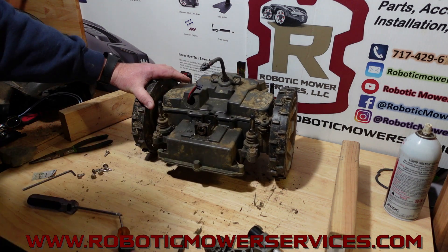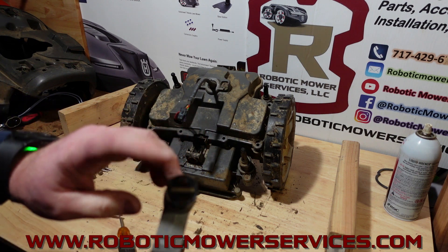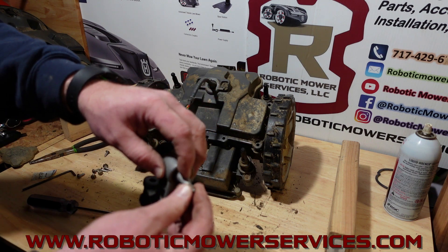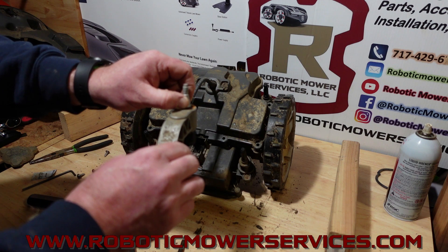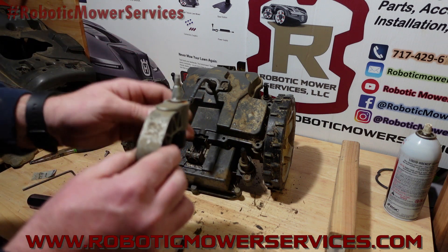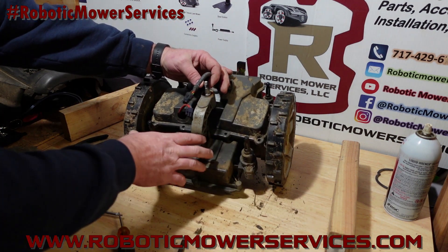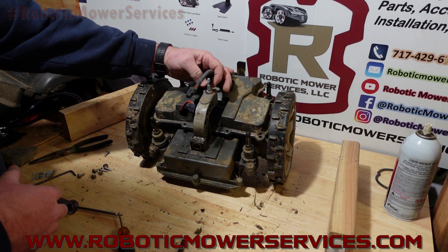This third board is the one that lines the back of the mower up with the front of the mower. You might ask where's the magnet for it — the third one, the one in the middle, is here in this arm, right at the bottom of this arm. That's why this has these slots cut into it, because this is indexed in the spine of the mower. It's tapered but also has a key in there kind of like a flywheel to line up with one of these grooves. When these grooves are lined up with that key it puts this thing straight in line with the spine of the mower, so that magnet is going straight across. Any time the back end or the front of the mower move and this is rotated, it rotates that magnet across the sensor board telling it hey, something just moved.